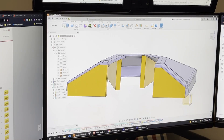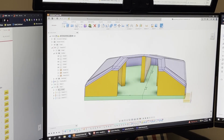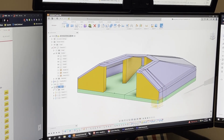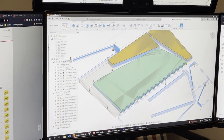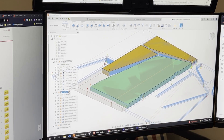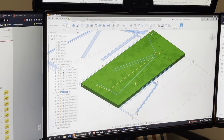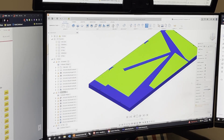Once it's all sliced up, we design a support structure out of a lower cost material to help hold everything together and keep the whole assembly rigid. With the surface sliced up and the support structure complete, it's time to create the tool paths that the CNC router will need to actually cut the foam. For this we use Fusion 360. After I calculate all the tool paths, I go to the router and start cutting the material to build the actual plug.